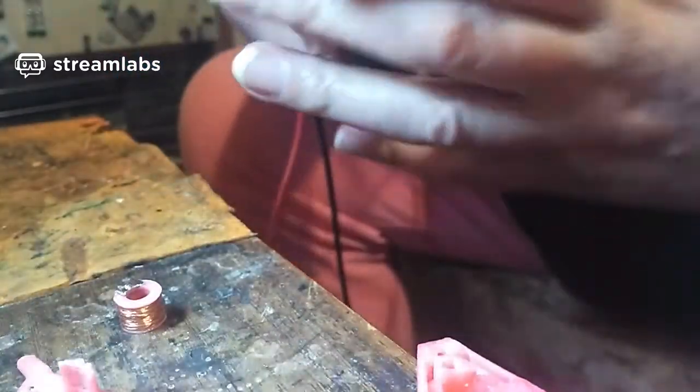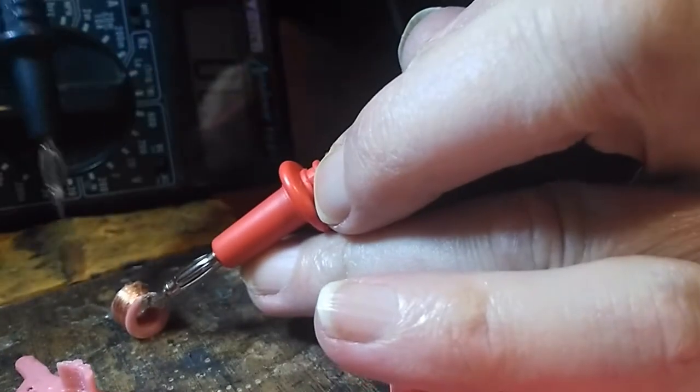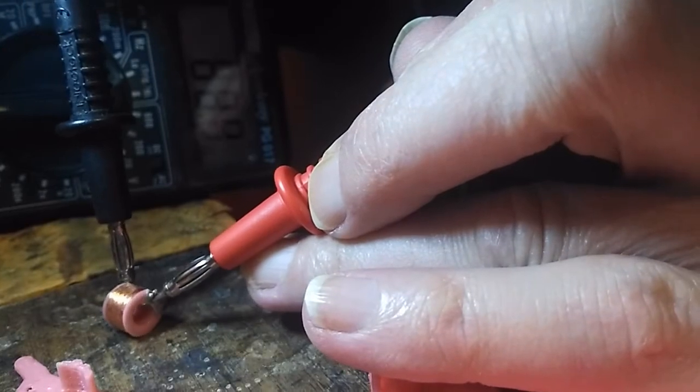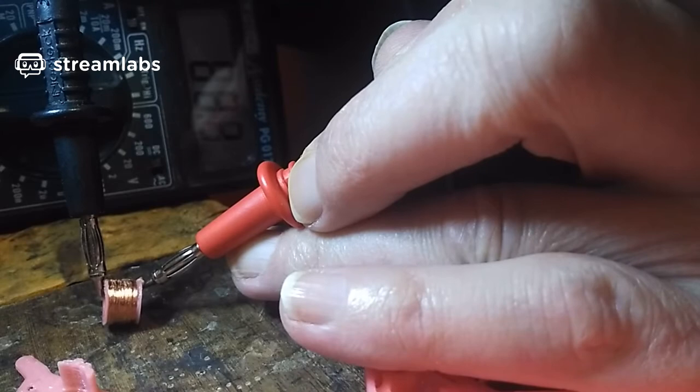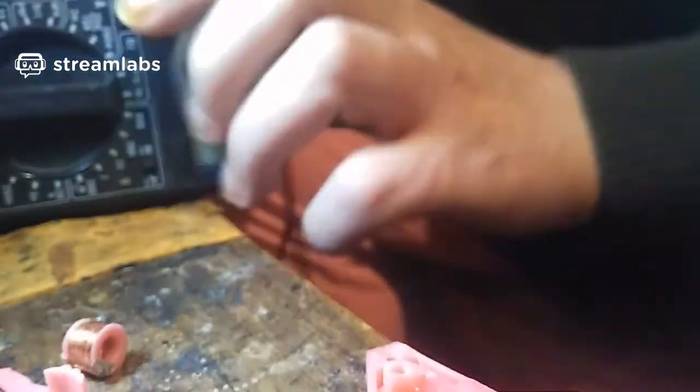So the coil goes in here like this. Let me just double-check it now — I snapped the wires off, it'd be annoying if it stopped working. Let's put the meter back so you can see what's going on. Right, let's check this coil again — make sure we've still got continuity. Looks like we have. There's not enough to make it beep but it's definitely working. The coil is still good, so that's alright.